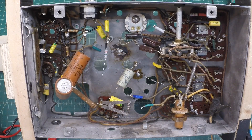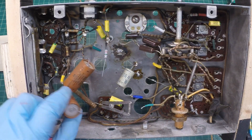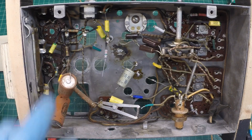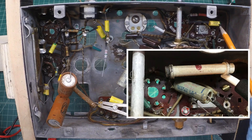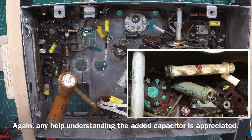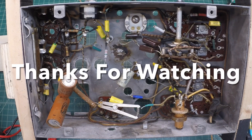My point of leaving off for today's efforts. I'll get back on this when time permits. I've got the out-of-tolerance resistors replaced with the exception of this one right here — it's tied to this mess on the B-plus side. This resistor is the wrong value; it should be 9K, but somebody put a 19,000 ohm resistor in, so we'll swap that out. Still got to get this paper cap out — this particular capacitor is not shown on the schematic, but I've placed it back as is for now. Just a quick update on my progress on the 62-316 Airline from 1936. Thanks for watching, we'll see you next time.